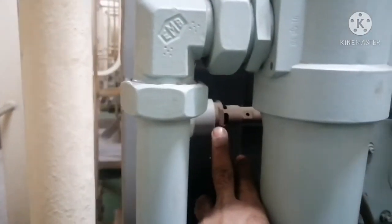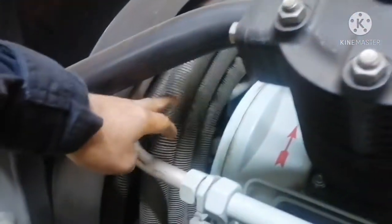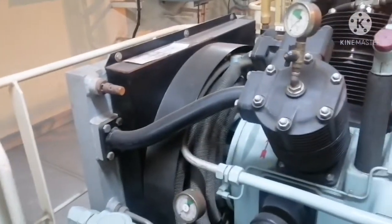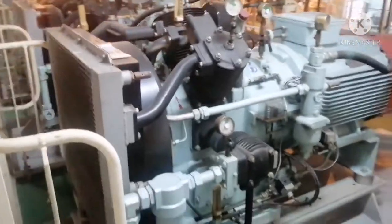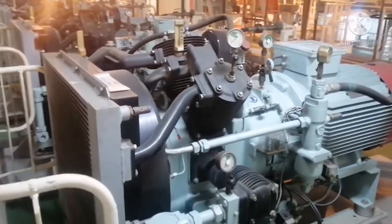The air cooler has two safety valves — one on the top and one on the bottom. The air pipe outlet of each stage passes through this fin-type air pipe, and the compressed air from each stage outlet passes through this pipe and gets cooled by atmospheric air before going to the next stage. This red color cap is your lube oil filling pipe. I believe I have given some basic information about the marine main air compressor. If you like this video, please like, share, and subscribe. Thanks for watching!